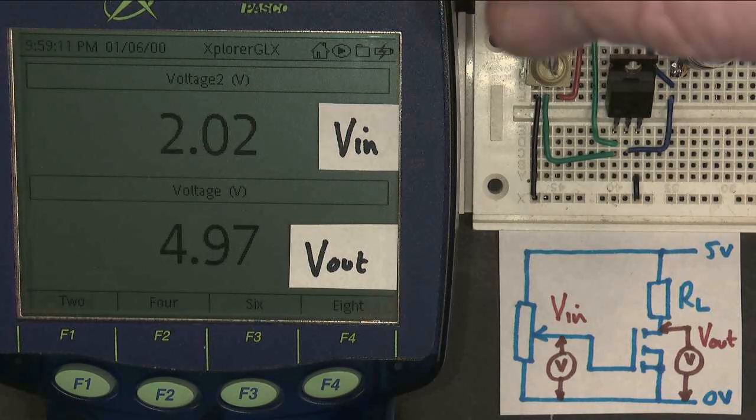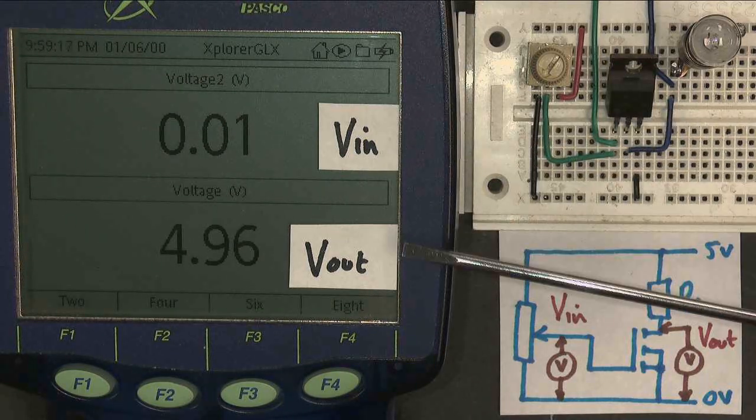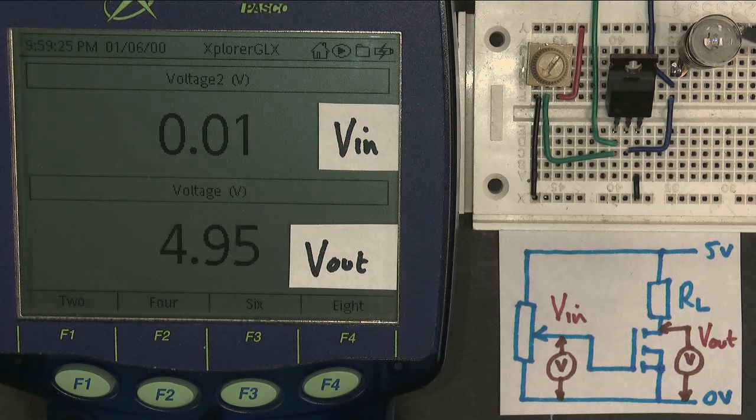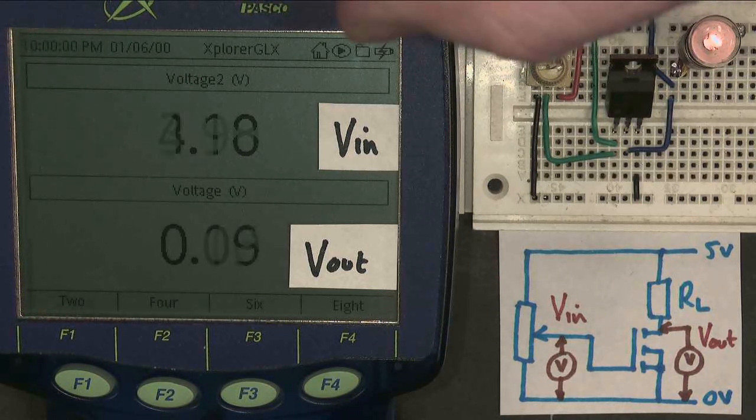The other scenario is this: now the input voltage is zero. The MOSFET is fully turned off and there is a large voltage across the MOSFET. Why? The MOSFET is turned off, there is no current flowing through the bulb, therefore there is no voltage drop across the bulb. This point on the top of the bulb is 5 volts, therefore the drain voltage is 5 volts. The source voltage is still zero, so the drain-source voltage is 5 volts. But there is no power being dissipated because there is no current flowing. So the MOSFET is perfectly okay. When a MOSFET is used as a transducer driver it should be fully off or fully on.